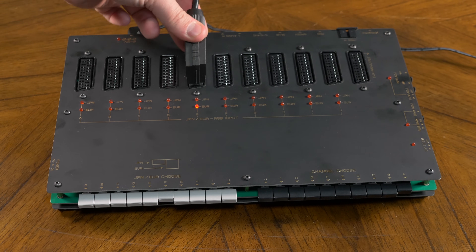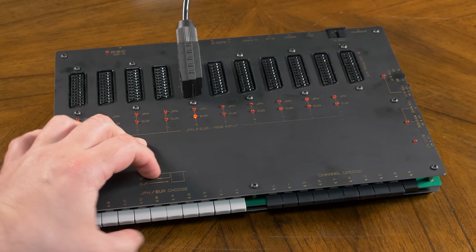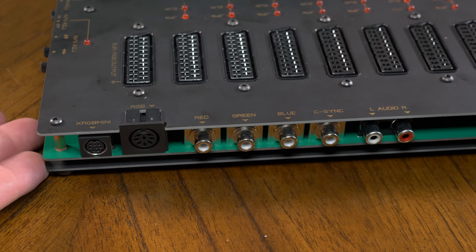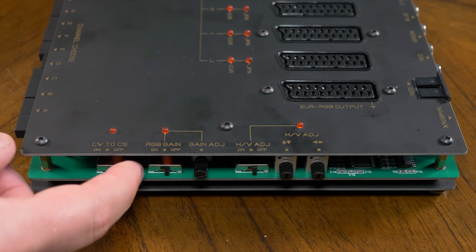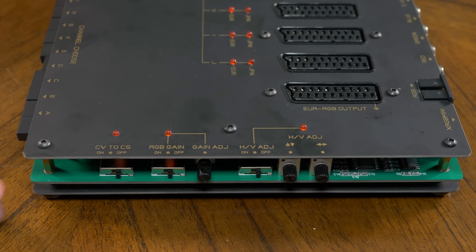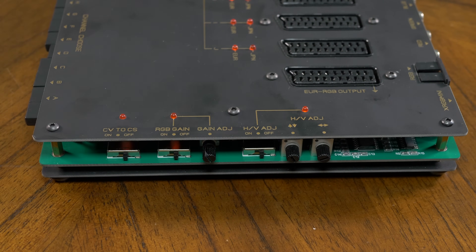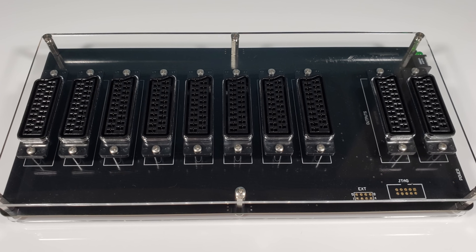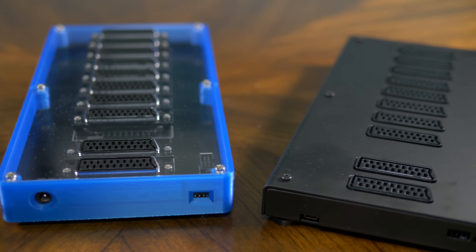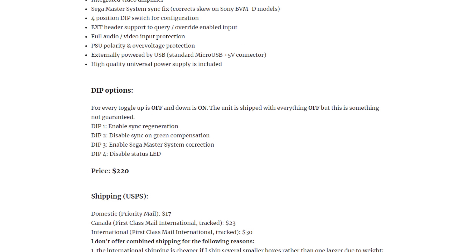I have two conclusions on the SCA101. First, if you simply need the ability to use both JP21 and SCART, I'd recommend buying the switch but not using the power supply — just use it as a basic switch and leave all expert features turned off. On the other hand, expert users might really be able to take advantage of this device. Someone running retro game tournaments would really appreciate the RGB gain control, especially to compensate for long cable runs, and the H&V controls can come in handy as well. My personal favorite is still the GSCART switch, though I'll admit I'm biased based on time. It has been around for a long time, and each revision has been passed through the hands of some of the pickiest, most brutal retro gamers all around the world — to call it thoroughly tested would be like calling the sun bright. It is expensive, though, so my recommendation is to pick what's best for you.